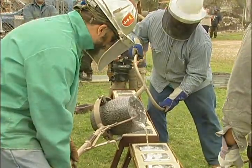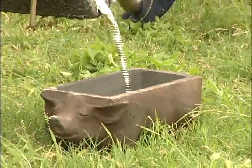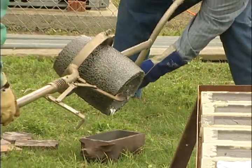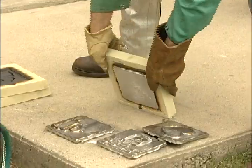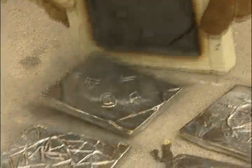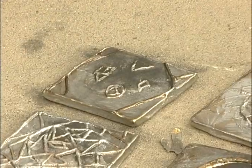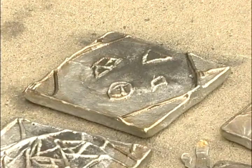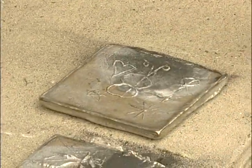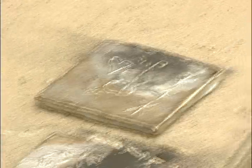Any excess aluminum is poured into the pig mold — and why it's called a pig is that in industry they call them pigs, or ingots. Here we are shaking out the cooled patterns. Even though they are sitting on the concrete, they are still very, very hot. So after this process, we take them to the quench tank and quench them in cold water.